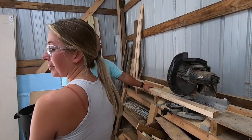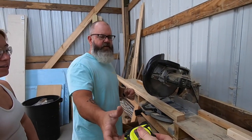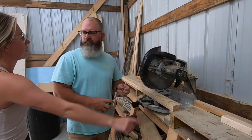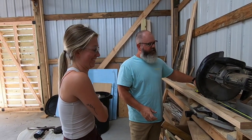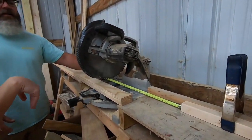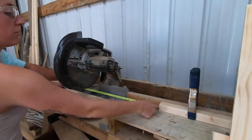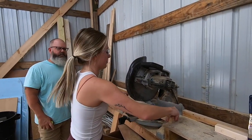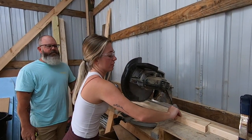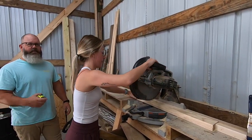Okay, so we need eight pieces of this, twenty inches. Look what I did — because you have a bunch of repetitive pieces, I put a stop up here. So now they'll all be repeated — this is twenty inches, this is twenty inches. I just have to put the wood flush with the stop block and keep cutting, so I get eight pieces and they'll all be exactly the same. Now you can't slam it up against there — just make it kiss and then cut it.